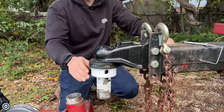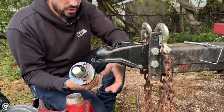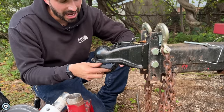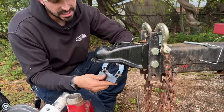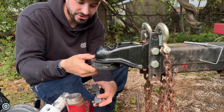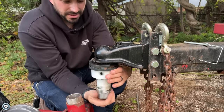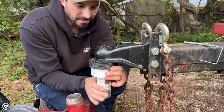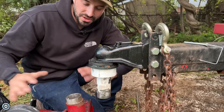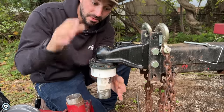The way this thing works: the threaded ball is threaded up into this collar, and basically when you have a drop hitch, that's why you use this spacer — the spacer sits here, then there's a little puzzle-piece key. The box I added is great because I don't want to lose this key. If you don't have a drop hitch, you pull out the spacer and now it goes nice and flush. The ball threads up into the socket, and the idea is you're creating a solid point of contact at the coupler versus letting the ball-and-socket move around. When it's all tight with the shim, the power caster basically can't pivot — that's how you move these things safely and keep them from popping out.